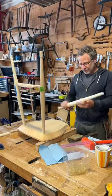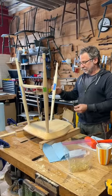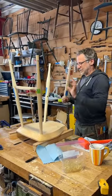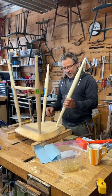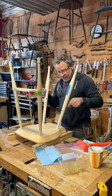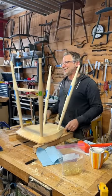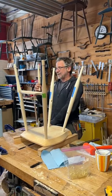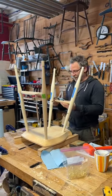I'm going to do the rear ones — I'll put them in here first. You're not gluing your legs into the seat now; it'd be very hard to get them out to put the other parts in. Now when I put this in, I have the same clues as before: do I have a joint here and joints going here? I do. Which one of these goes in there? The one with the big tenons. This is my back one.